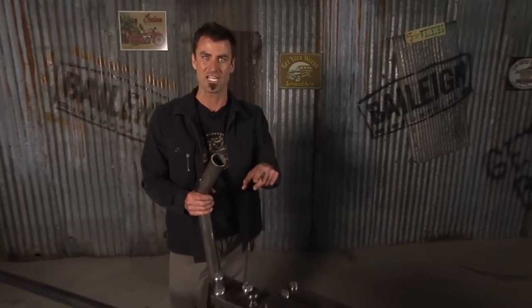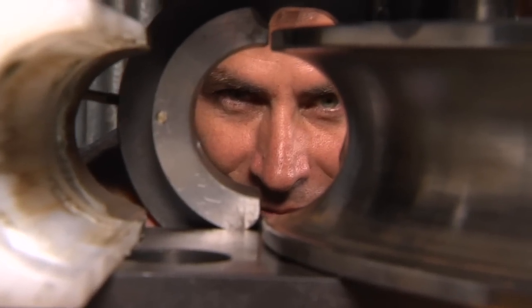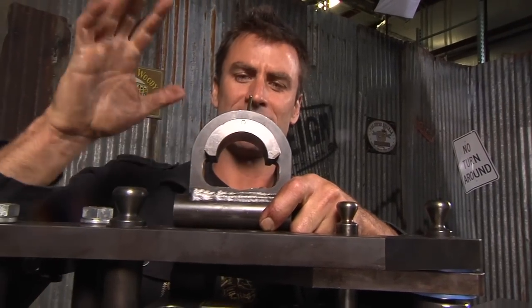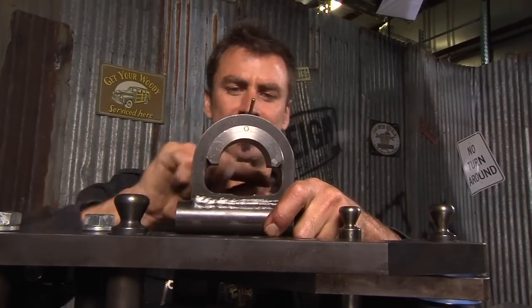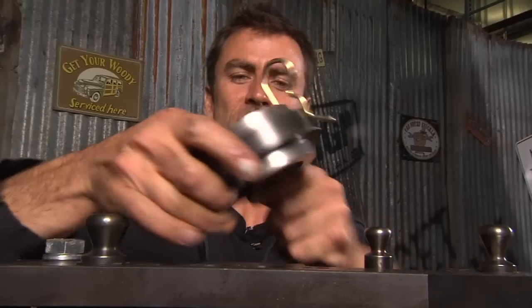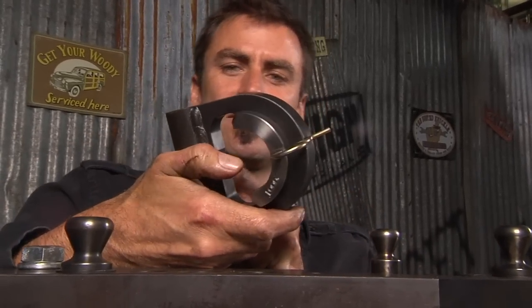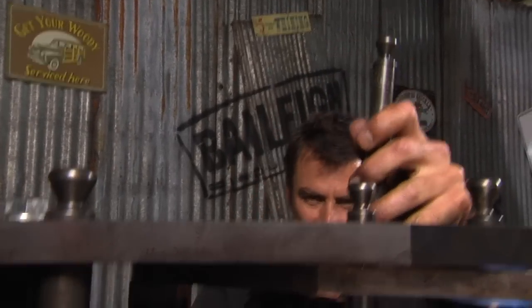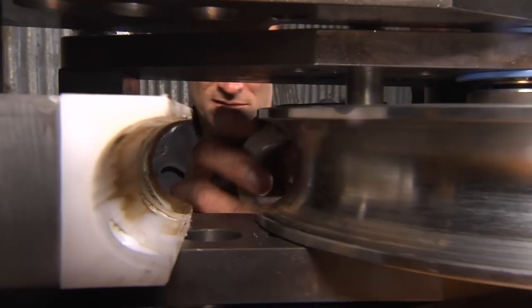So that's a pretty cool machine. This is called a U-strap — normally these really aren't accurate at all, they're welded, they're kind of nasty. This is called a hook sleeve, and it's machined, and it's got a removable, replaceable piece. So once it gets some wear in it, you'll actually be able to replace that — something you won't find in most entry-level machines like this.